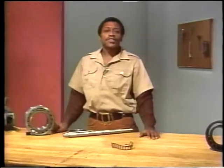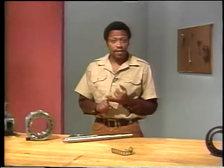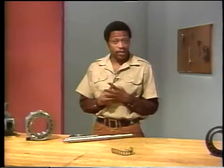With each failure we discuss, we'll cover 4 points: what it is, what it looks like, what causes it, and what we can do to prevent it. Now, with the first failure we're going to look at, fatigue failure, you should know up front that we can't prevent this type. We can only delay it. It happens to every bearing eventually. It means that the bearing wore out.